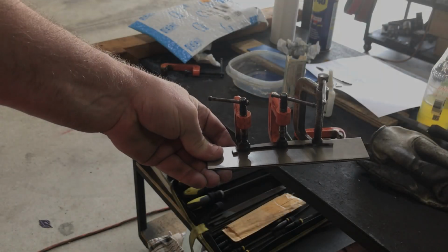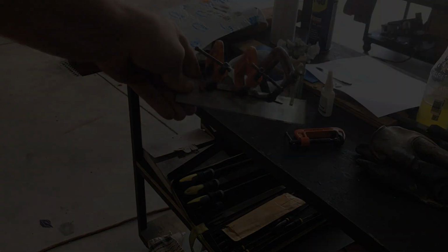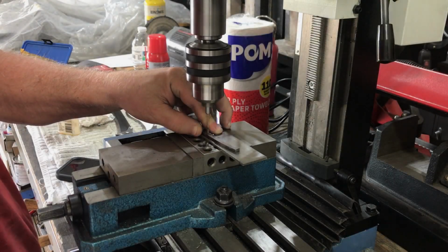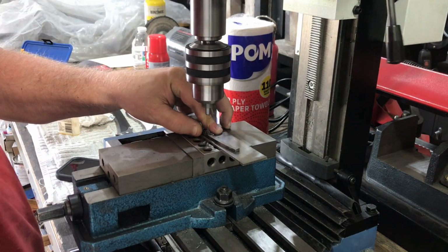After supergluing the two liners together, I also superglued to the liners the different components of the knife, the lock back, the blade, and the butt end, so that I can use those as the template to drill out the pin holes.